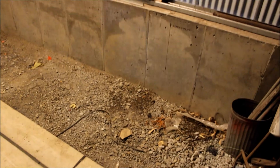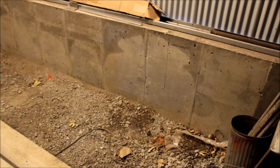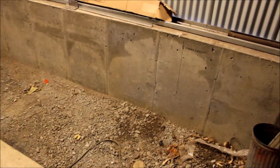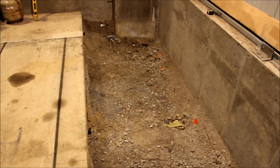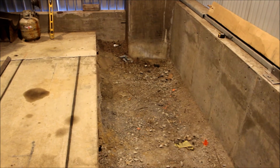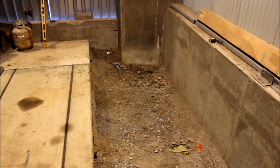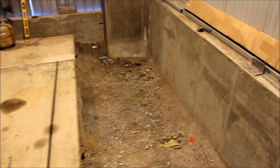Starting about right here in this area will be a block of concrete 7 feet by about 4 feet by about 5 or 6 feet deep, reinforced, and that's what the drive will all sit on. And then back in here, this will be dug out about another foot and a half to 2 feet, a wall formed up, a floor poured, and that will give me about 4 foot 4 inches by 9 feet by about 3 feet deep, which will be the oil sump.